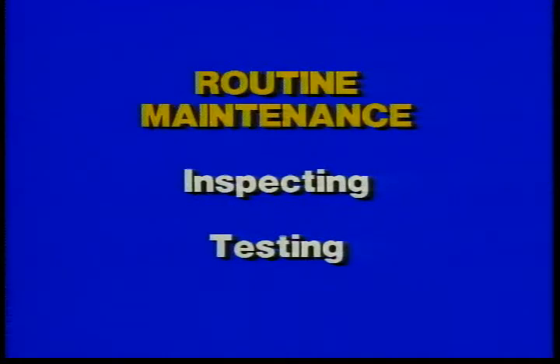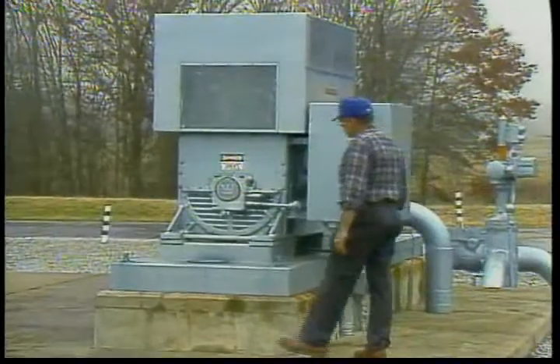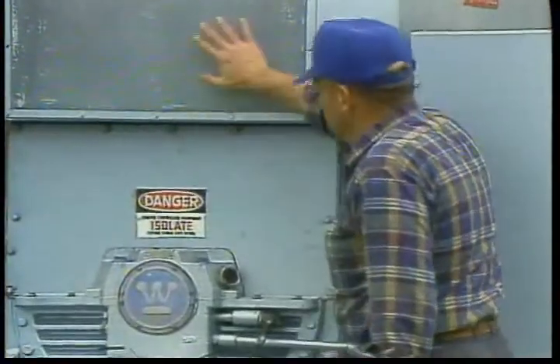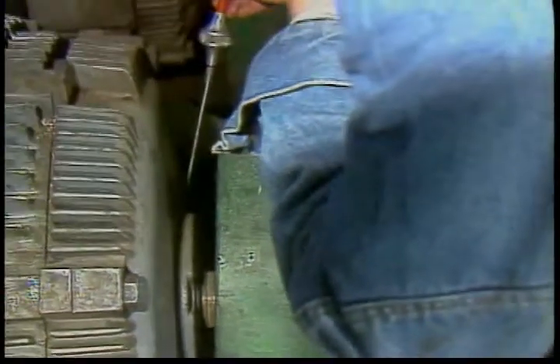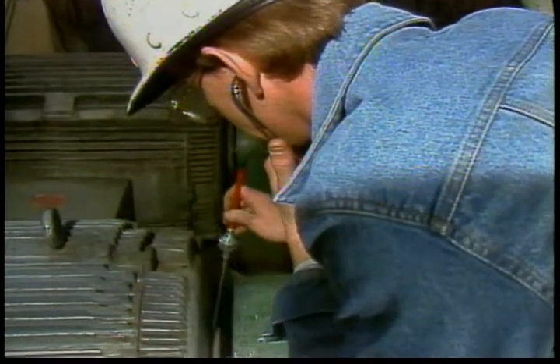The other part of motor maintenance involves inspection and testing on motors to detect problems before they become obvious or lead to a breakdown. Some tests are as simple as watching and listening to the motor. If a centrifugal switch flashes abnormally, something is wrong. If an AC motor hums or buzzes, it may be under too heavy a load or might have loose core laminations. Vibration, squealing, or dragging or scraping noises in any motor probably means serious bearing problems or a rubbing rotor.